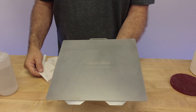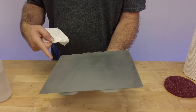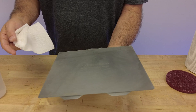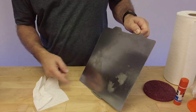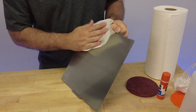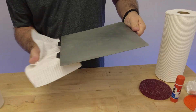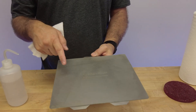There are still some scratches, but this is going to behave very well. If you really want it perfect, keep going - we've only done about two to three minutes. I recommend going four to five minutes to get that perfect finish. This has been just under two minutes of sanding - if we go four or five minutes we can really get that uniform finish, but this is enough to give you the grip and prevent bonding. If the back of it got dirty on the table surface, you want to quickly wash that off and dry it. Make sure it's dry before touching any magnet, because alcohol can destroy the surface finish on the magnets.